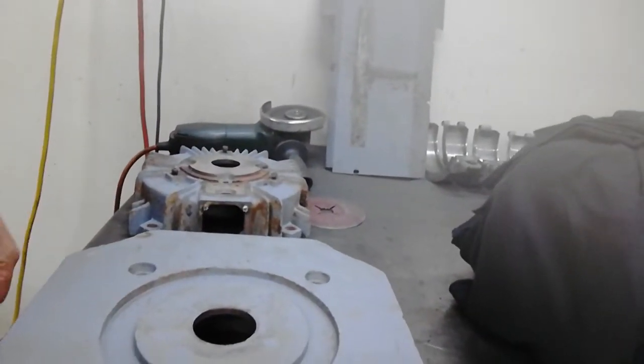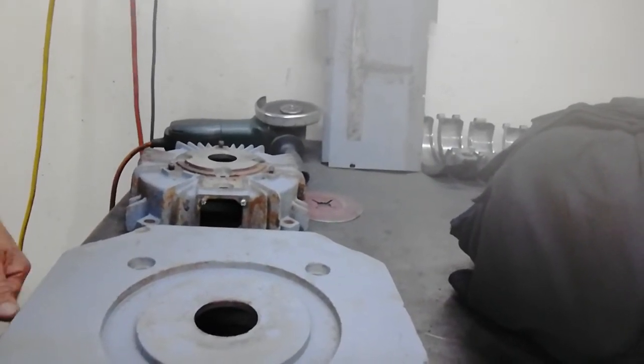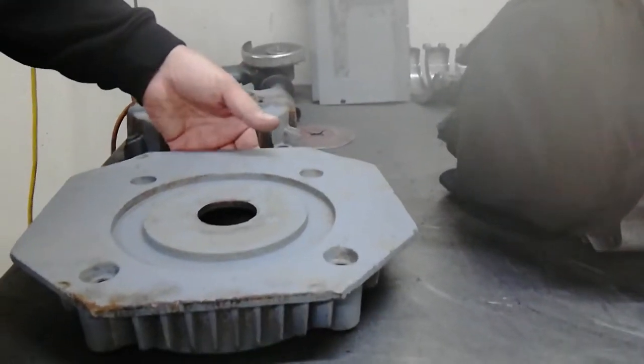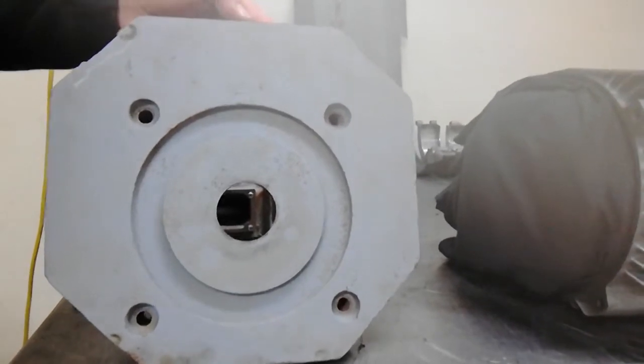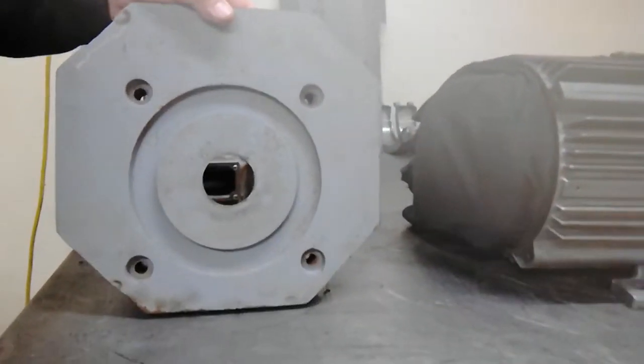So you have to wash the parts in water after you've washed them, and obviously you need to dry them well, which is a bit of a pain, but it does wash very well. These will be blasted anyway, so I'm just washing off the excess grease and so forth to get them ready for blasting at the moment, as with those other small parts that I showed you.